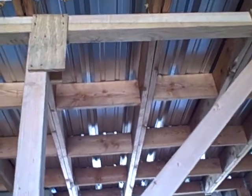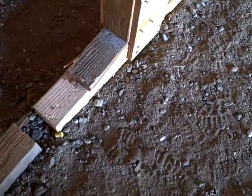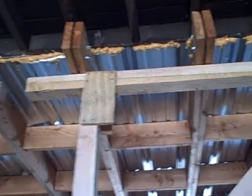So the total height, minus 3.5 for the header, minus 3.5 for the sole plate — that equals 7. Plus the inch and a half to 2 inches for the 2x4 wedges. So you've got a 6-foot header.